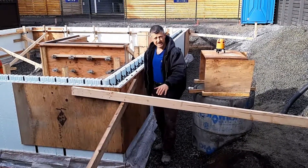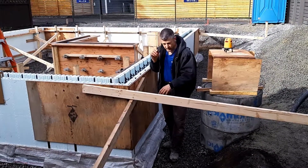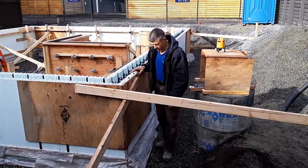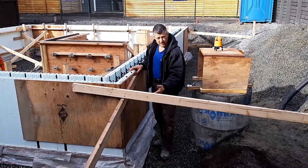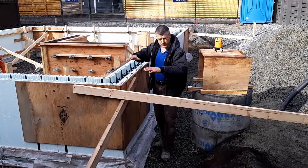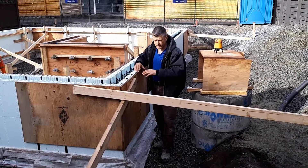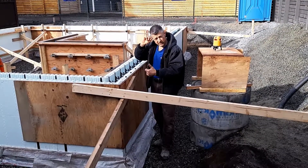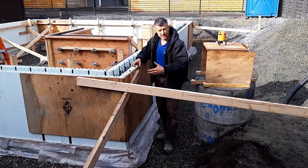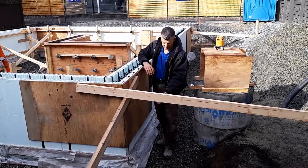Get it as flat and straight as possible, because it's a lot better for adjusting the legs later on — you're not going to have way different depths in your footing. So you lay your bag down on the rock first, then put your ICF blocks on it. Centering your bag can be a bit tricky, but that's the best way to do it. On this particular one there are three rows of 15mm steel down below — a bit challenging to get in there. We had to lift up the walls after we got them leveled up and slid them underneath the legs.